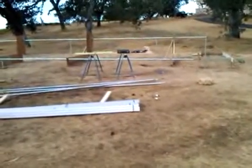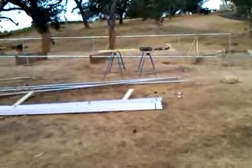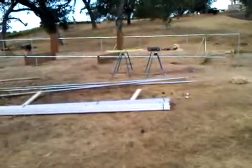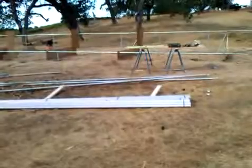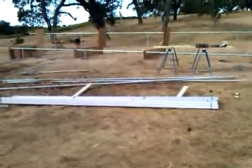We're back here at 9705 Windsor Road doing the 8.5 kilowatt PV ground mount system. We're still working on the rack, and I'm going to describe what I did today. You can see the vertical posts on the front horizontal and back horizontal piping are laid in the pier holes, and I'll take you through how I did that today.